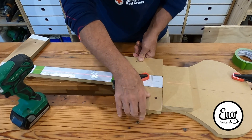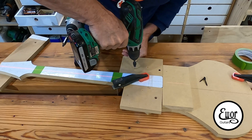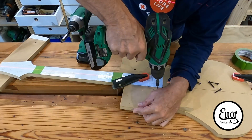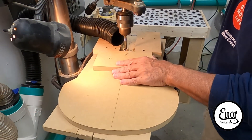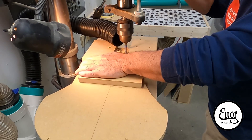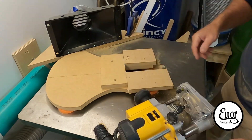I've still got my laser line on here and I've got three blocks — I've actually run these through a joiner. These are the blocks I'm going to screw down to form the pocket I'm going to route. I've got these two guys going here and this one's going on the bottom, pushed in tight. Everything's clamped down so it shouldn't move, but I'll keep that laser on it just in case. I'm pre-drilling my holes — I have a countersink bit set for the exact depth of the screws and I drill through both pieces. If you don't countersink and pre-drill, those little boards will shift, and you want them absolutely tight to that neck template. Then I drill out the bulk of the material inside and take it over to the router using a half-inch top-bearing flush-trim pattern bit to cut out the rest. That half-inch bit matches the radius on the end of the neck template, so it'll fit in there really well. I take several passes, a little depth at a time.